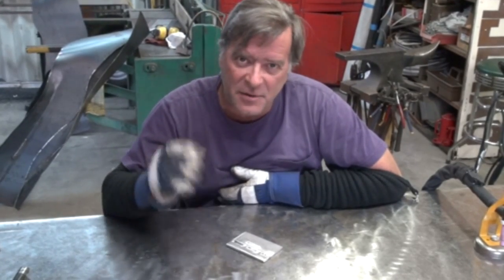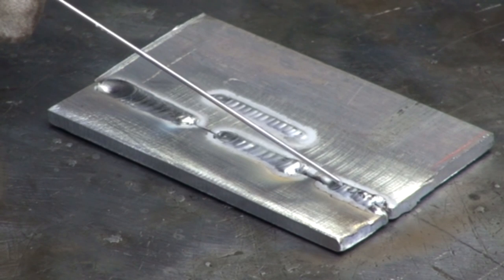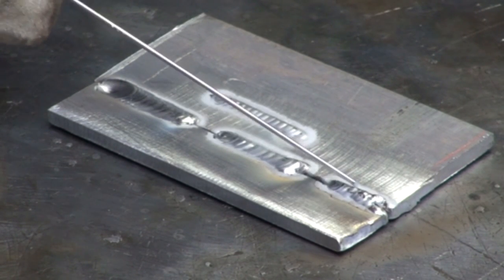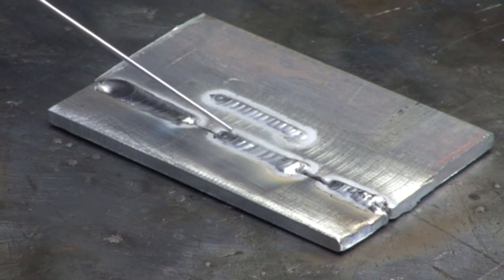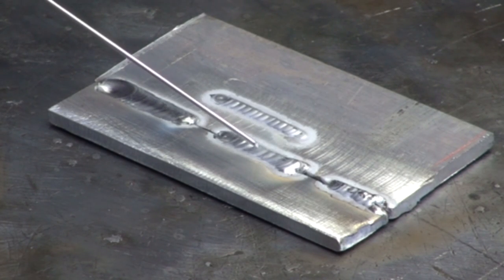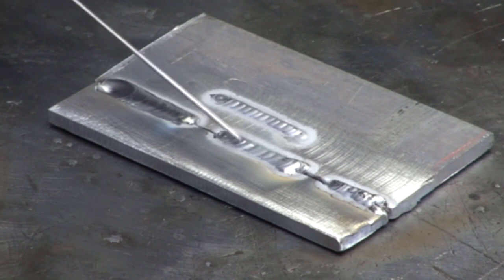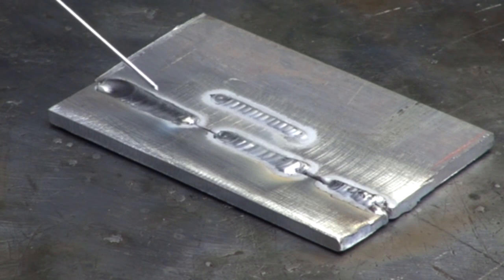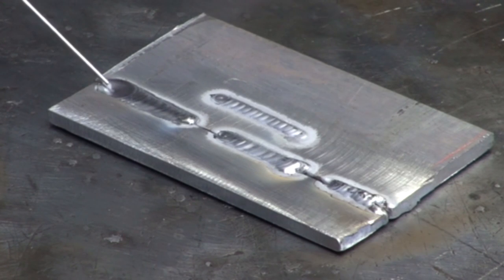So let's look at these — remember, no other settings were changed. Here's the sine wave. It looks kind of cold, lots of cleaning. And then I came over to the soft square — a little flatter, a little warmer. Of course, it was getting a little heat from the first weld also. But then we came over to the advanced square. Look at the difference in the size of the bead — a lot more power, spread out a lot more, wet in a lot more. The crater at the end — that's my fault.